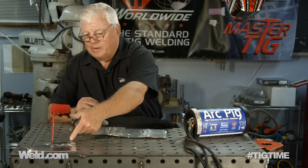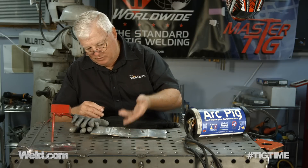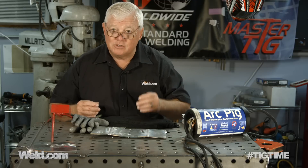On this one I'm going to set it — I'm at 16 gauge, so I'm going to set it at about 60 amps. This one here is 125 thousandths thick, so I'm going to set it somewhere around 125 amps. And just know that these buzz boxes got the name because they do buzz — they've got a lot of copper, they're pretty robust.